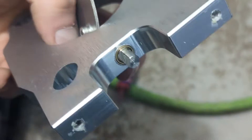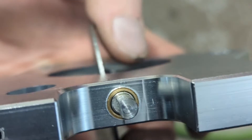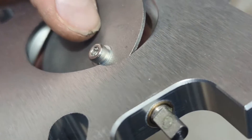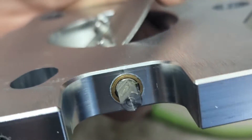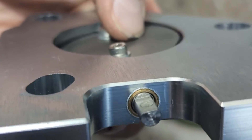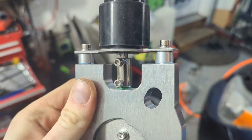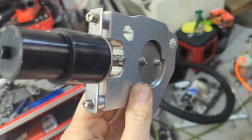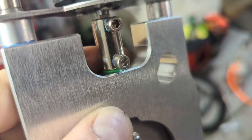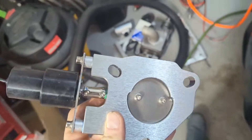Here is the bypass valve disassembled. There's that axle that the motor turns and it's fairly loose fitting, so what I'd like to do is stick an O-ring plugging most if not all of the gap that exists here. The O-ring is now installed and I even kind of squished it down a bit. This will probably add some resistance to the operation of the valve but I was able to turn it by hand before tightening the set screw.